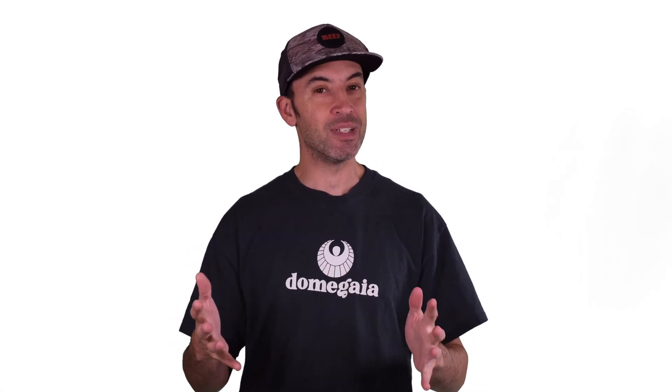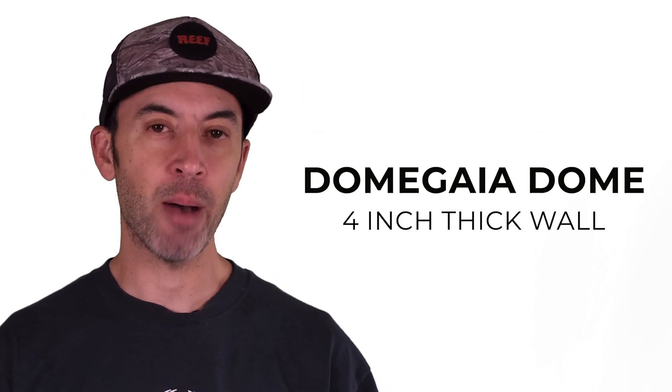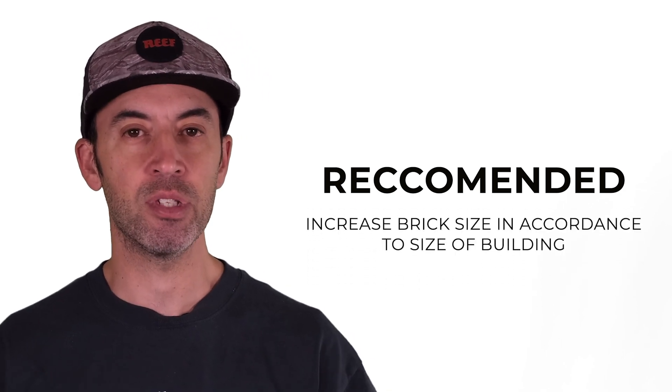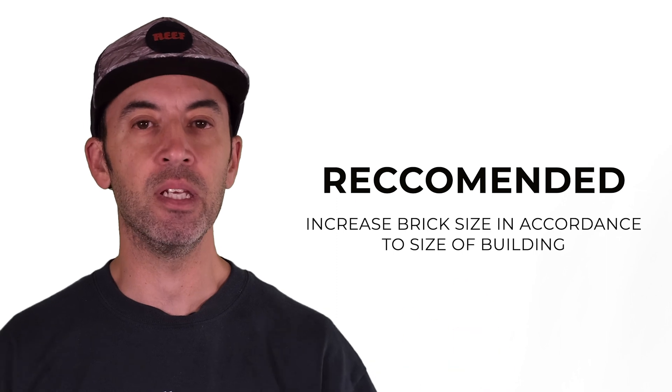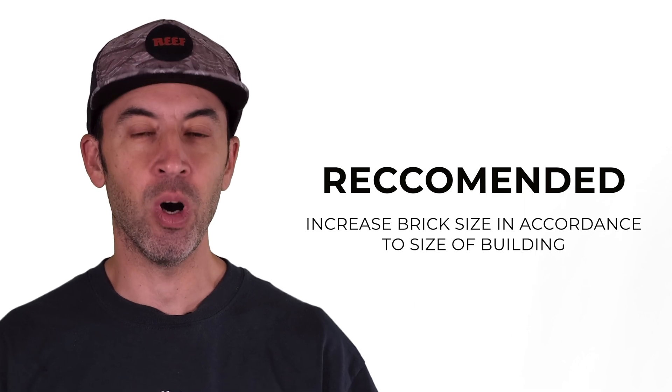If you're building your own aircrete dome, you can go as thick as you want. Building with a 6-inch or 8-inch block can actually be easier in some cases and adds a lot of extra R-value. When building domes, we start with 4 inches thick — typically for tropical environments and smaller domes in the 16-foot diameter range. As you go bigger, we'd recommend using a 6-inch brick, and technically you just need a thicker brick as you scale up. For a 20-foot dome, you can still use a 4-inch thick brick, but we'd recommend 6–8 inches for the most integrity. Going bigger than 20 feet, we'd definitely be in the 6–8 inch range. If you want a super-insulated house, think around 12 inches for a great insulated aircrete wall.